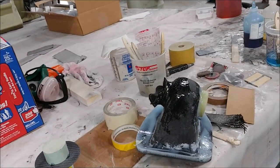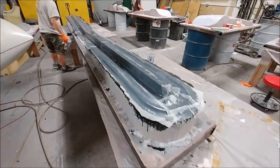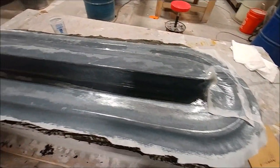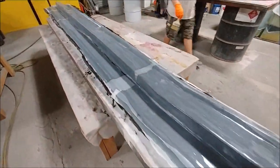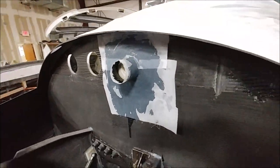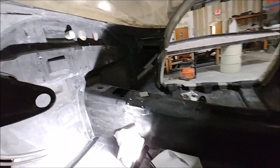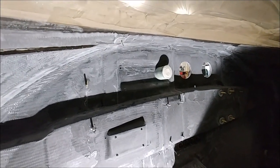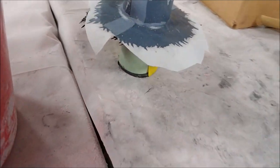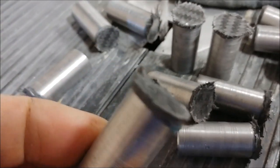Here's Jeff working on bonding in those FR4 tubes for the aileron controls, the rudder, and also the one for the elevator control which is in the forward bulkhead. The guys got the first lightweight layer down for the four-plane spar mold — that'll need to set up for a day or so, and probably next week they'll be putting the heavyweight layers on. There's the pass-through for the elevator control: an FR4 tube with bearings on either side, allowing transfer of motion through the forward bulkhead without losing any pressurization. There's also the one Jeff finished for the aileron control — same type, pressure-tight bearings on either side — and the one for the rudder control transferring through the keel.